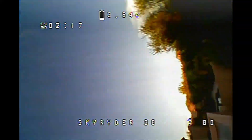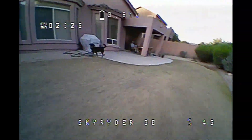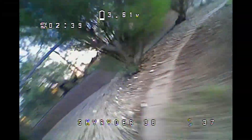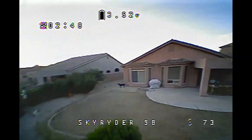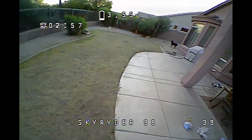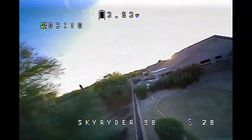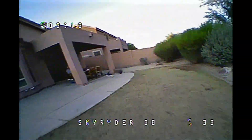Some things you're not going to fully get out of it even with a great tune is eliminating that little bit of prop wash — you just don't have big blades, and you're carrying a pretty big battery for the size of the props and motors. That always means you'll get into a little rough air. But with this being so small, I'm not worried about flying it in tighter spots. If you're at a park and worried somebody might pop out unexpectedly, at this size versus something like a 3-inch 1203 build with a 720 battery, this is going to be much more reasonable.